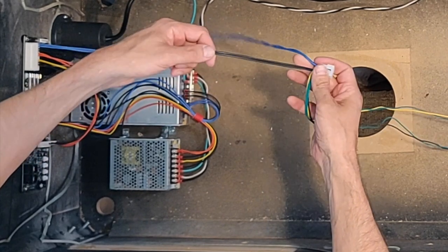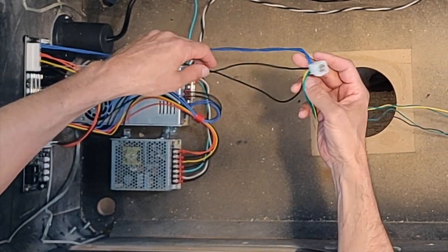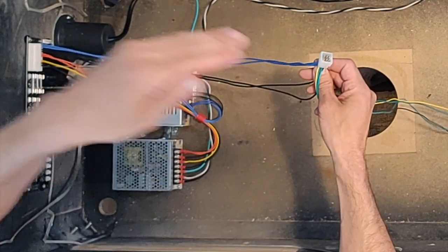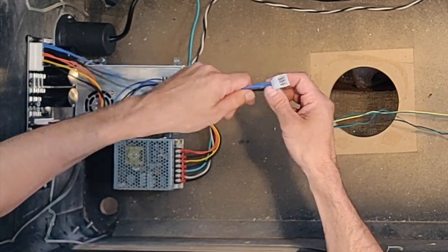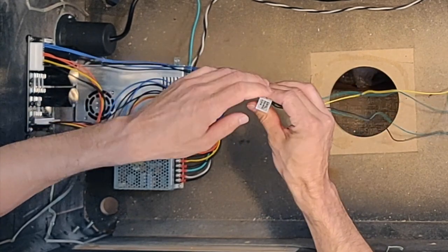We also have these two black wires that serve as our grounds for everything. These are going to run straight into our I/O boards, and the grounds from each I/O board to the other can all be connected in a daisy chain, so everything's grounded properly. So these are going straight into items. Now, you'll say, well, Steve, you got these on this quick connect, disconnect item here.